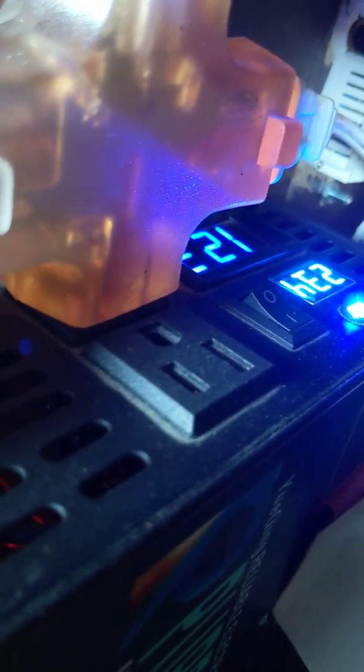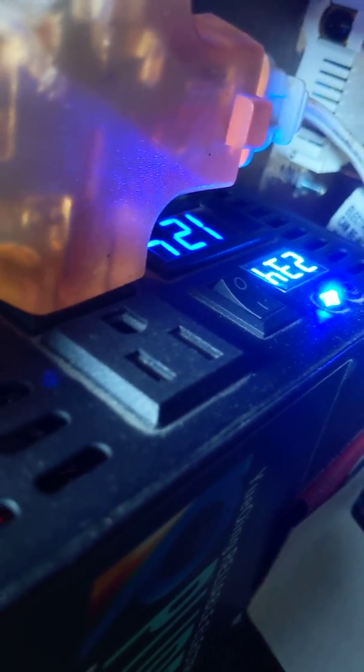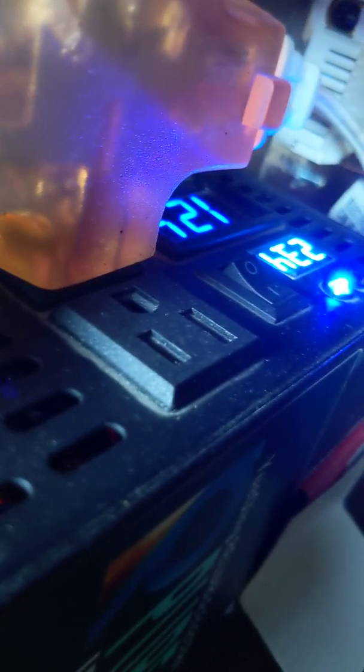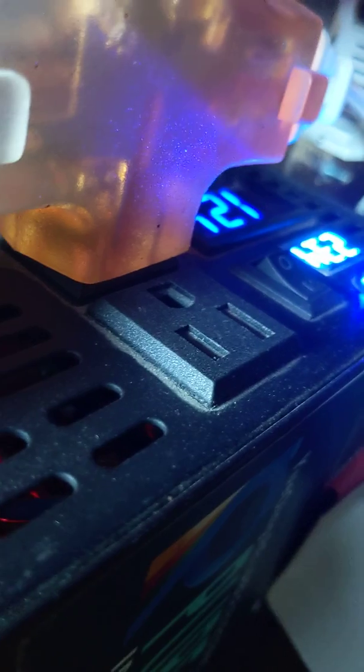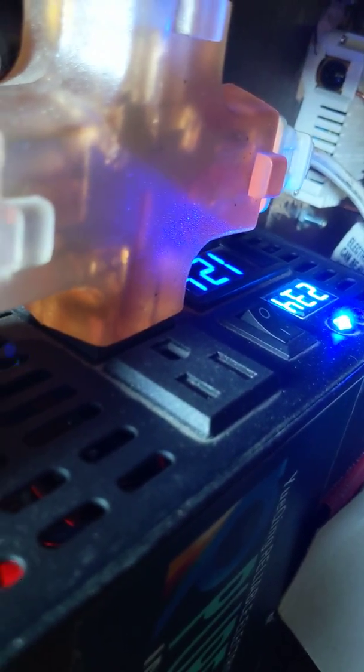These two outlets. Now, I see a lot of people plug in some pretty heavy machinery into these two outlets, and don't ask me why, but every inverter ever made that's got these on there, or offers them as an option, uses like 14 gauge or smaller wire to actually connect these. These plugs go in here, and when they connect to the power source, they are only using tiny little 14 or 16 gauge wires. So that's why I really don't plug anything too heavy in.